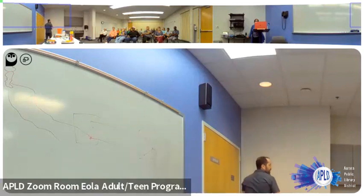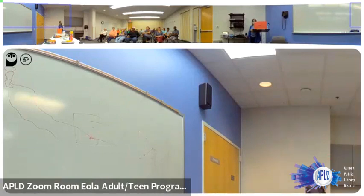Heating and air conditioning. Not only do I recommend hiring out, there's very, very little that you can do yourself, except for change the furnace filter often. My advice is the cheapest filter that fits in the box. Change it every 30 days.